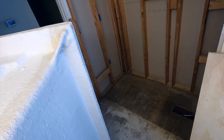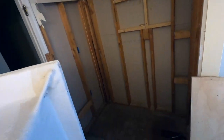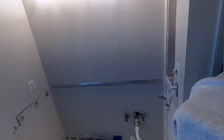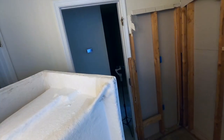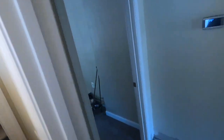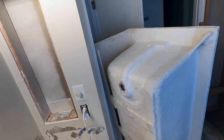Here's the plywood, here's the valve, and I can get to the plumbing really easily since I have the ceiling open downstairs. The apron on this tub is huge, so it's not an easy install - I can slide it right in here since I have room, but in an actual alcove that just has walls like in the other bathroom, the tub is so big you really need a lot of room to get it slanted in. That's why that tub chipped.